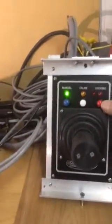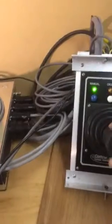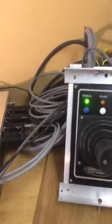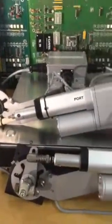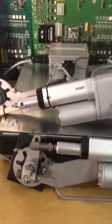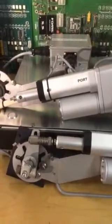Now if we go to the docking mode — which is the best feature of these kinds of systems for jets — it has a self-centering joystick. The joystick returns to center. So if we move to the docking point, they go back to their neutral center place. When you move the joystick forward or aft, you can see these just barely move and they'll move in small increments, following the joystick.